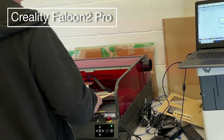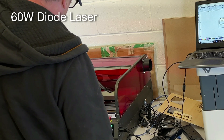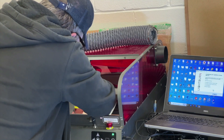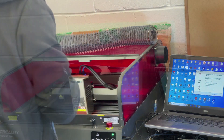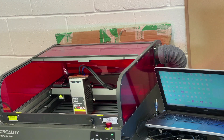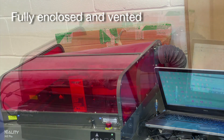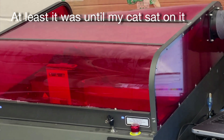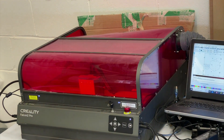The laser cutter I'm using is the Creality Falcon 2 Pro and my version has 60 watts of power, which is a lot more than you need for this. I think Kevin used something like 5 watts. The nice thing about this is it's fully enclosed and super powerful, but I should have cut it with lower power to match Kevin's settings, because my chassis came out a little bit wobbly — the spot size of the 60 watt is a lot bigger than Kevin's 5. I could have adjusted the kerf or cut down the power, but this laser is a really nice size for doing robots. It's compact, it sits on the desk, it's got a lot of power, it's really easy to use, and you can usually get a really good price.